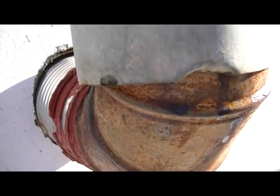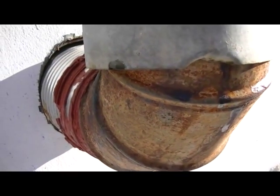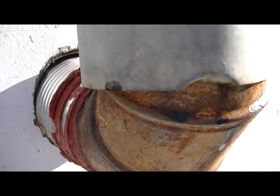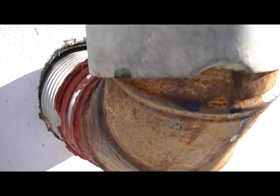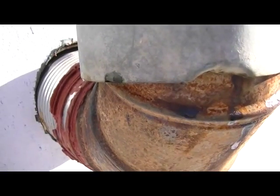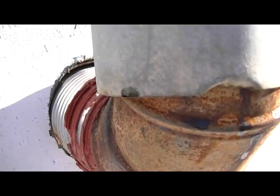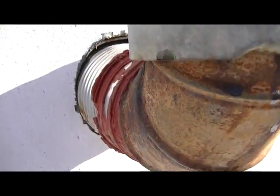The only reason I have the stack on the side of this semi is because the wind regularly comes from this side, and that provides a windshield to keep the stove from backdrafting into the shop when the wind hits the end of the chimney. I could dump the chimney down and underneath, but I don't want fumes coming up under the trailer where I might breathe them. So I send them up — they stop about 10 inches short of the top of the trailer.